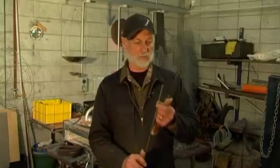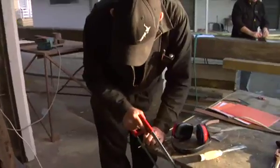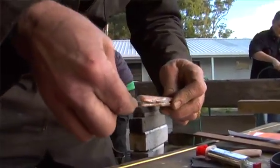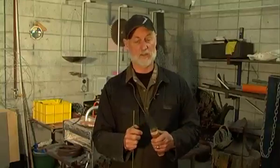A bit of brass rod here — these holes were drilled for this particular rod. Cut your length of brass to that shape. Then using a two-part glue that's going to set pretty hard and tough, coat both sides of the wooden handles. Put your pins in, squeeze in a clamp and let that lot set. Then once that's set, grind off, smooth off, sand down to shape and finish.